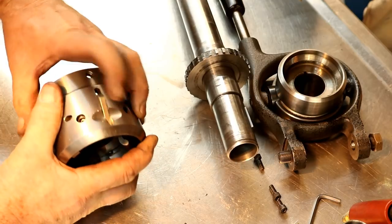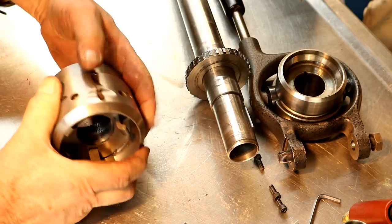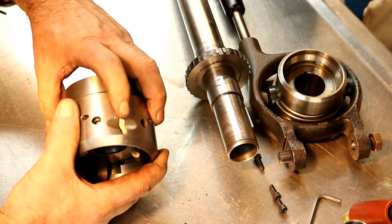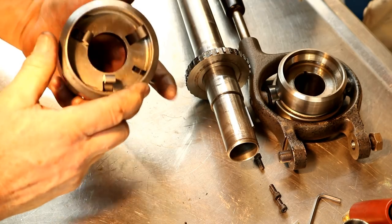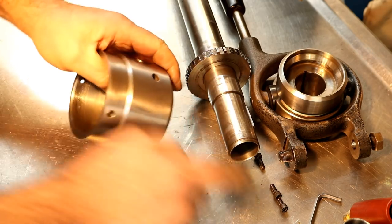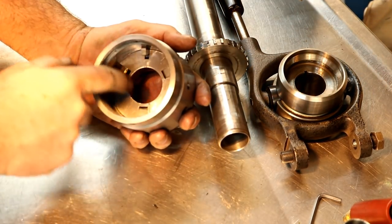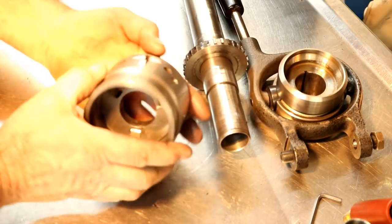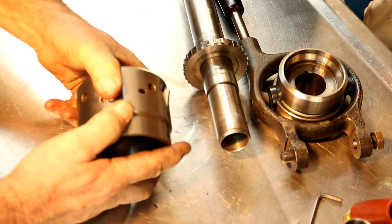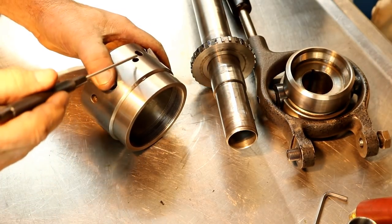Now this didn't work. This was kind of sticky before, and I took it apart. I knocked the pins out, cleaned it up, and I got this working a lot better. It wouldn't stay in position. It wouldn't stay locked in. It's like the spring wasn't working right. And I already took those screws out. Those screws hold the inner pieces in that hold the dogs. Yeah, I have to take this out to get to this. That's a pin that has to be punched out. So there's a pin down in here.